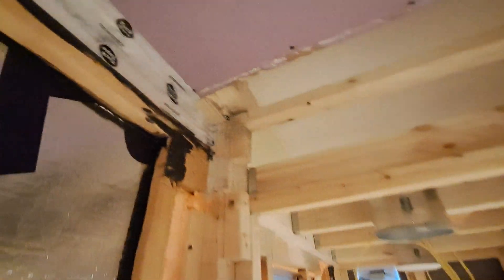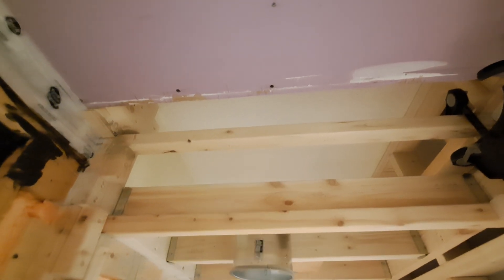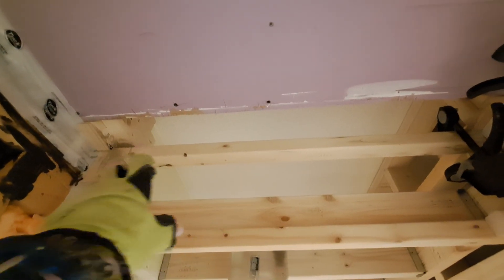I'll give you a better bird's eye view inside. I still have to do a little bit of work up here. I have nice fastening spots on either edge, but I don't have anything in the middle. Even though that shiplap is pretty rigid, I might be able to get away with it — but I do have crown, and I'm thinking maybe I should do something a little more heavy duty spanning across here. I need to put in a nailer up and down.